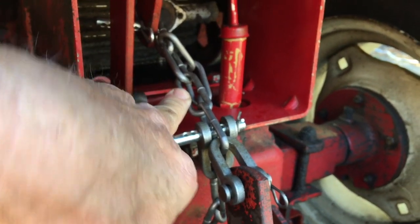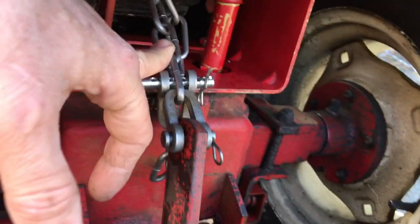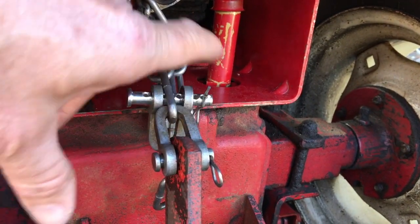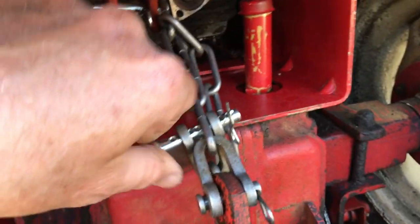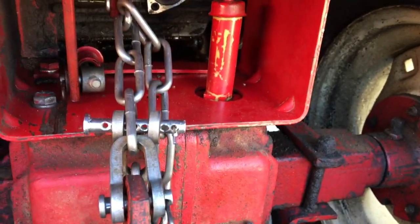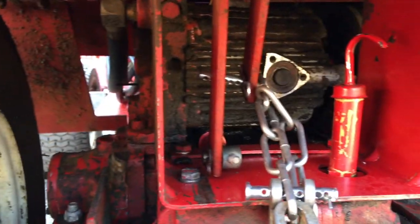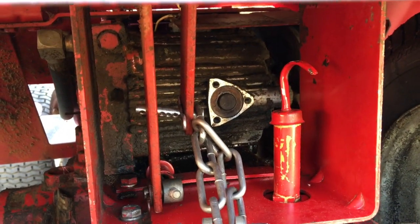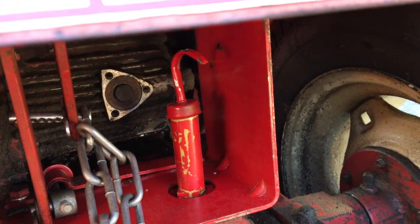This is the original chain — this was really corroded, I couldn't believe it. This was another example of vinegar: I'm going to be talking about how good vinegar is for cleaning rust throughout these videos. I don't know that you'd need anything else because vinegar just works so well. This stuff came out like brand new from rust and whitish corrosion. I've got a lot of original pins and clips — I keep everything original that I can. I try to use brass brushes so I don't damage surfaces too much when cleaning. This chain came with the clevis hitch and it's kind of a standard Wheel Horse chain — versatile for different implements.